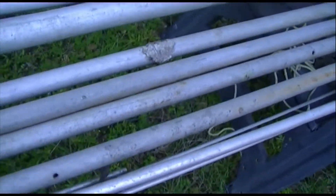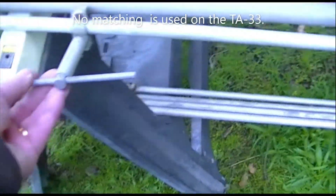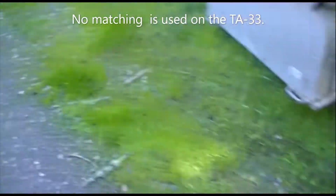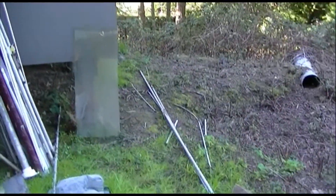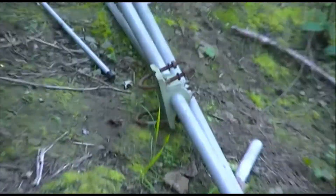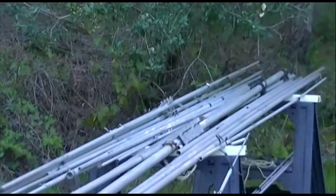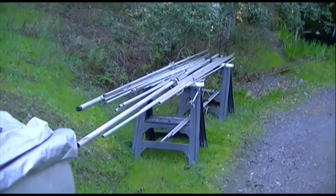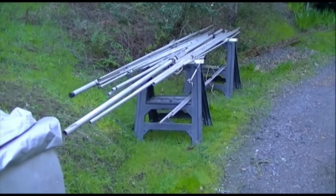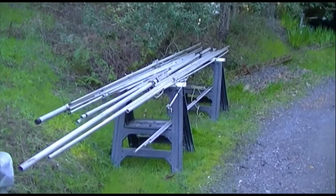Then there's some stuff here that may or may not be part of the Moseley, and I think this might be the gamma match for the Moseley — I'm not sure. There's more junk left over too. Some of that hardware doesn't have anything to do with the Moseley, it's something else. So the only thing I know to do is get the Moseley manual, look at each of the elements — how long they are, what they're made of, how many pieces — and start measuring and cataloging what I have, then mix and match until we figure out what goes where.